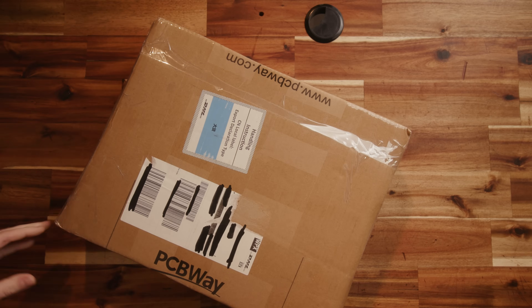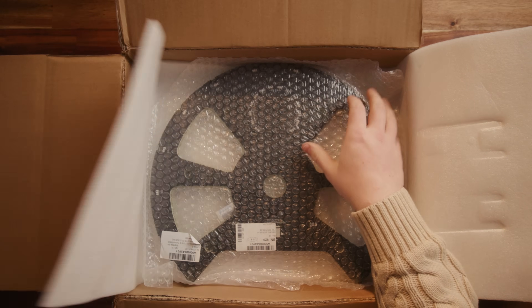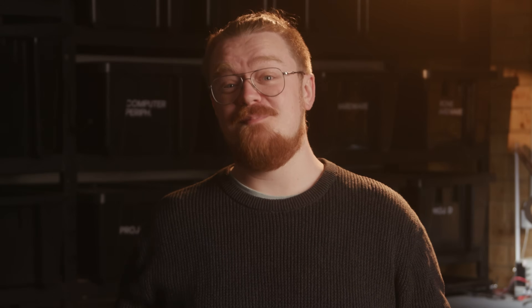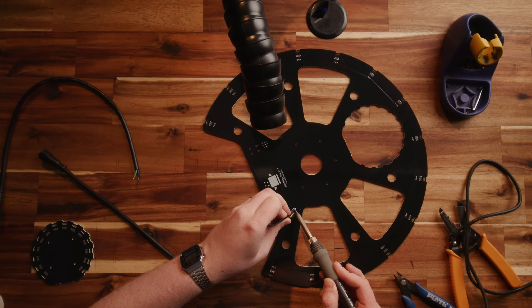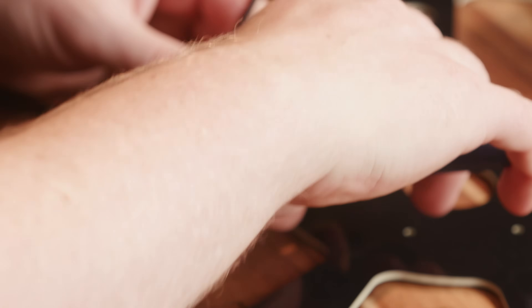After waiting a little while, I got a nice big box from PCBWay. Some of these are for other Christmas projects, so get subscribed if you don't want to miss those. What we're interested in right now are my MiniTree PCBs. They came up incredibly well. The PCB has pads for 14 strings of seed pixels, and with 25mm pixels and a 600mm riser, each tree will have just shy of 400 pixels on it — which means you can run two trees off of one pixel port. The PCBs come as one piece with the topper inside the bottom PCB; to remove it, you just push it back and forth till it comes free. The top and bottom PCB both have a positive and ground bus to ensure consistent brightness over the whole tree, so you shouldn't need power injection midway along, even with 5V seed pixels. They include pads and zip tie strain relief holes for your waterproof connector pigtails on the input and output side.